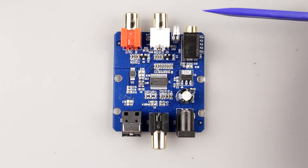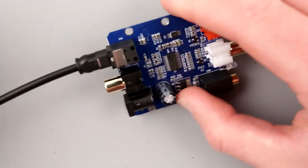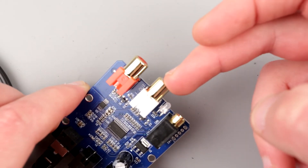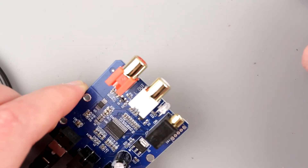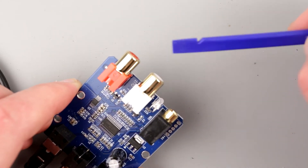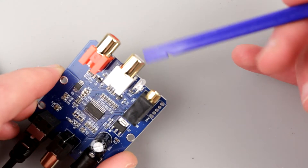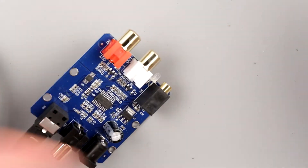I think I can just try to power it up and it should be straightforward. I'll connect it to the computer via optical. From the RCA outputs I'll take a linear stereo signal. I'd also like to check the output voltage level, because some people have mentioned this device may have a positive DC offset on the outputs, which is not good. Technically it can be filtered with a capacitor just to make sure that DC offset isn't reaching the RCA jacks, but I need to measure it.